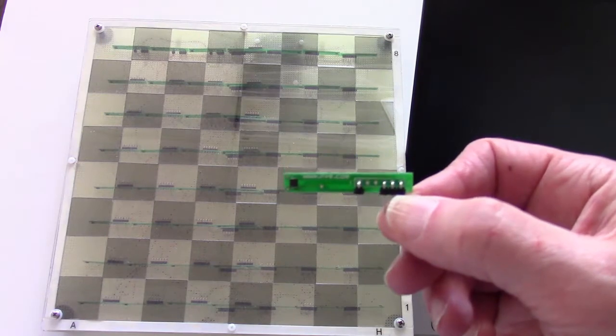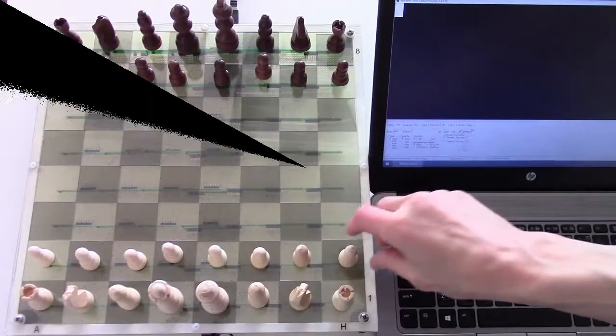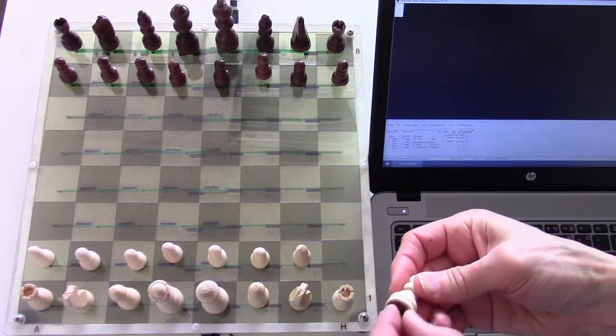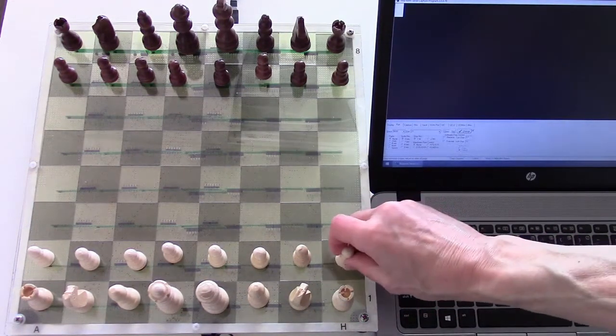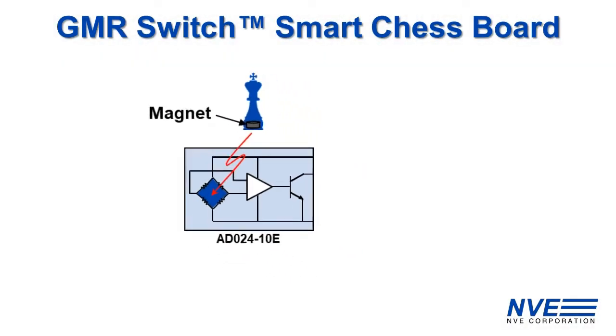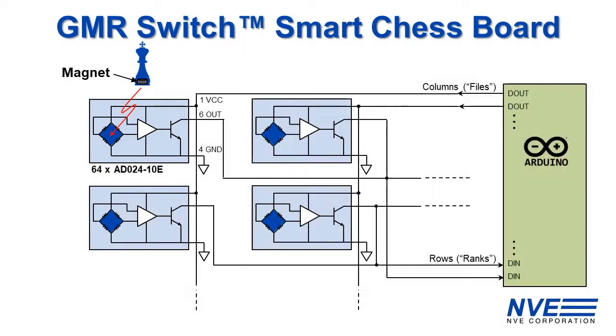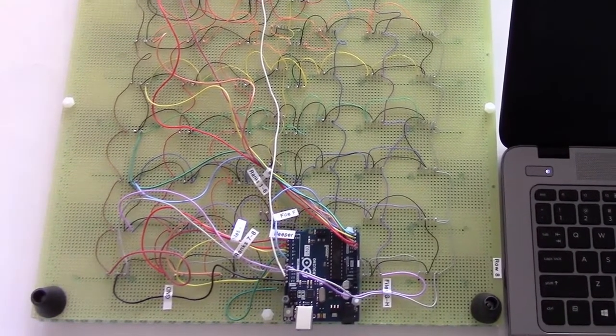The sensors are mounted on demo boards. GMR sensors are sensitive enough to activate with the small ferrite magnets in these magnetic chess set pieces. Here's the schematic — the sensor outputs are open collector, so they can be wire-OR'd together. We wire-wrapped all 64 boards to the Arduino.